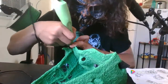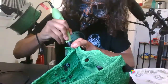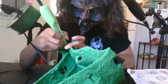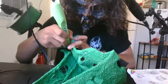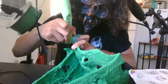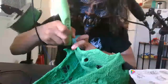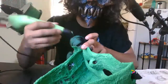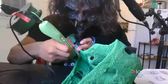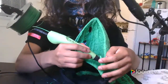And I'm kind of moving quickly, so then the layers can be really thin. I figure that helps bond it together more, because if it's thin, every time you're heating the plastic again when you pass through it, it's going to melt that and bond it to the part under it and below it. So I feel like working fast and thin helps everything bond together better.